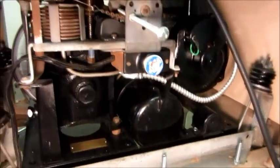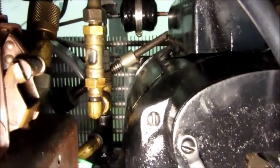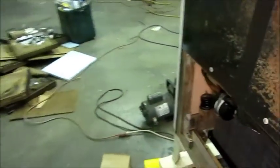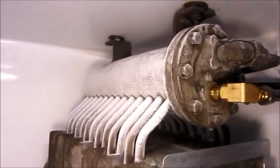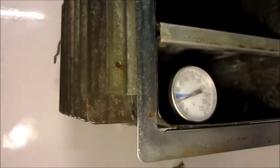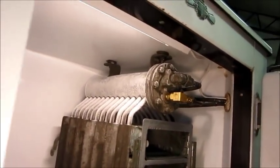It's got four cans of refrigerant — 10-ounce cans of R152A — running about 10 psi on the low side. If you look in there you can see the refrigerant going through the sight glass. It's very quiet to be such a lot of moving parts. Check that out — we have first frost! It's between 25 and 30 on the temp gauge, and that is with no door gasket — none is installed yet. But there is a problem; it still needs some adjustments.